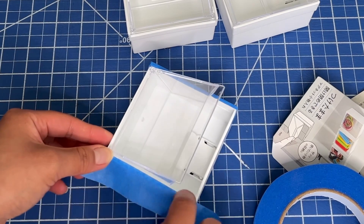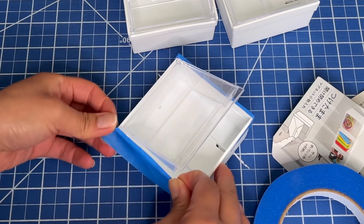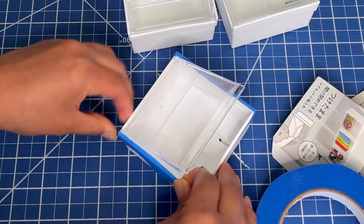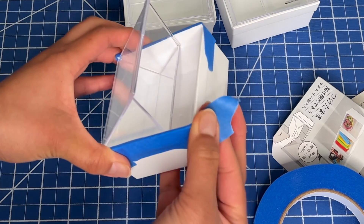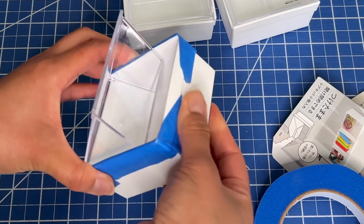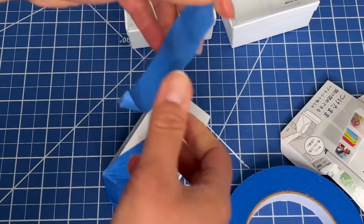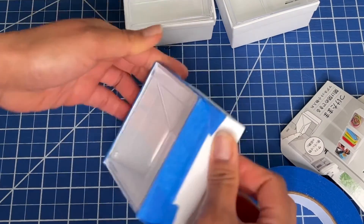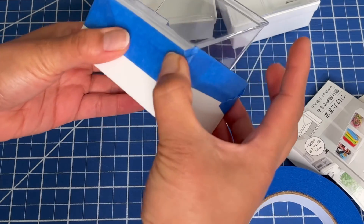A tip — or more of a word of caution — is that you have to make sure you don't have any tape sticking up. You want it smooth and flat. That's why for the corners I'm just folding them in so it's more secure. You don't want any of this to stick up during printing because that will rub off onto your printhead, and that's not good. So keep it smooth and just be mindful of that.